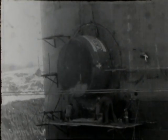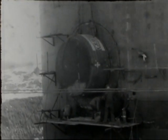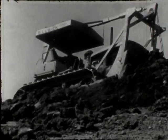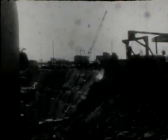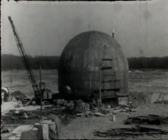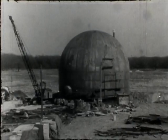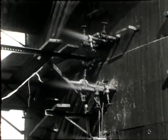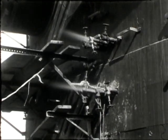The protrusion shown is a personnel airlock which will be at the ground floor level. Entry through an airlock assures that the shell is pressure tight at all times. When the concrete was cured, the earth backfill was moved in. The structure is designed to withstand an internal pressure of fifteen pounds per square inch with a safety factor of four. Air pressure at eighteen and three-quarters pounds per square inch was maintained in the building for ten days and not a single leak — a mark of fine workmanship.